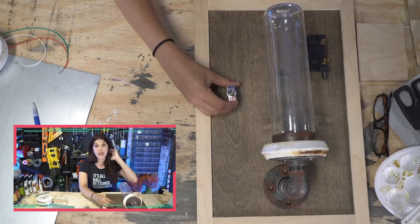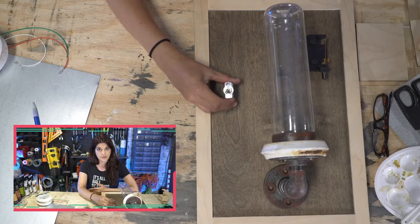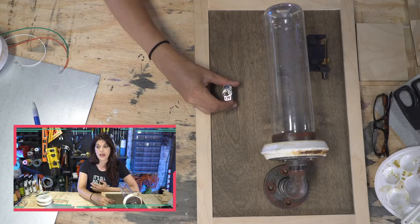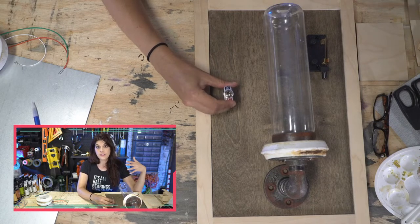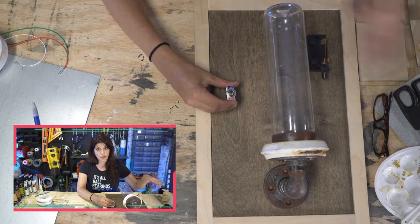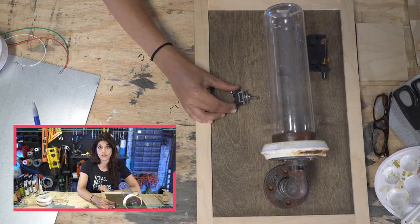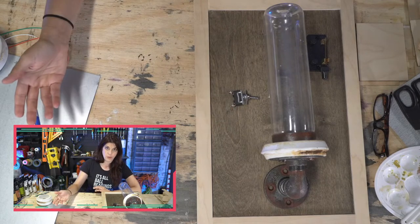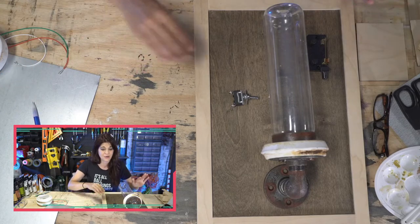I'm either going to use 9 or 12 volts, probably 12, to power everything, because the lights need 5, the Arduino needs 5, the lightning detector needs 3.3, and there are all the various pumps that we're using. I thought about using buck converters to convert down so we don't fry anything, so it'll go from 12 to 5 for the lights and from 12 to 3.3 for the lightning detector. I got a whole bunch of buck converters that I'll connect up.